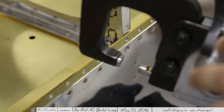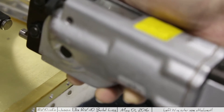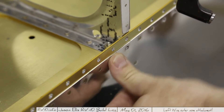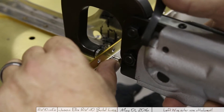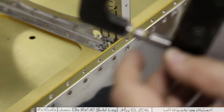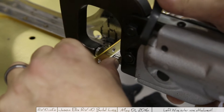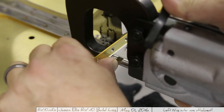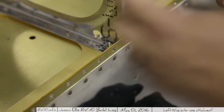One way they get around that is they've got a replacement button that turns it into a foot trigger down here. I don't have one of those. So instead, what I've learned to do is put my thumb right here and hold this bottom piece — the piece that moves — so that it doesn't slide. You square it up, get it where it needs to go, and it's the only thing that doesn't move. Everything else moves, and we have a perfectly set rivet.